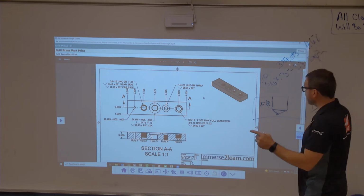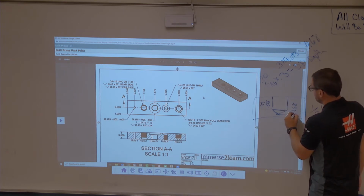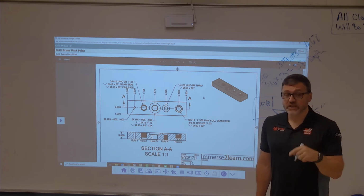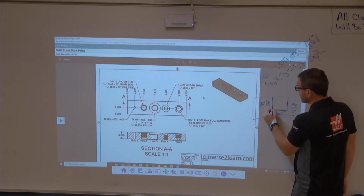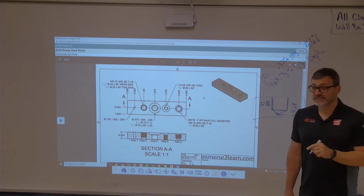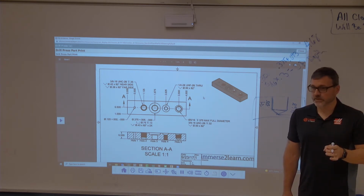So that means you have to drill to point to the tip 468 thousandths in order to get that 375 full depth. Now you can check that after you drill it by running your scale, depth micrometer, or edge of your calipers down here to make sure that you get a full 375 deep of diameter, okay?